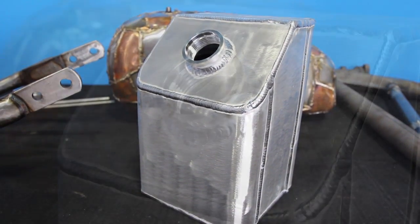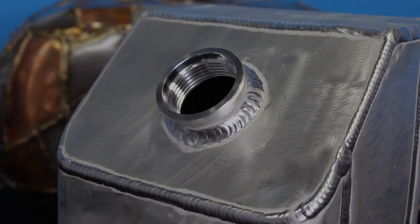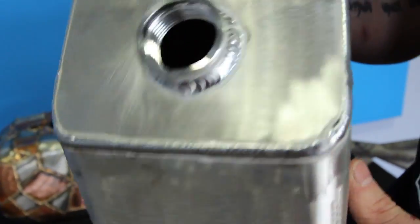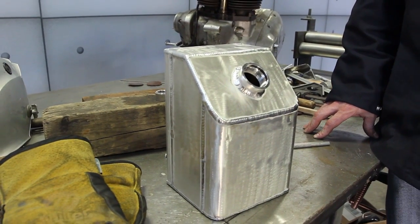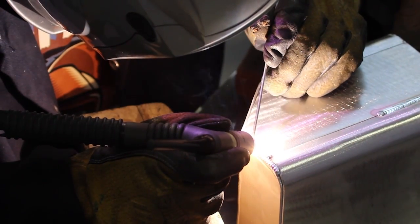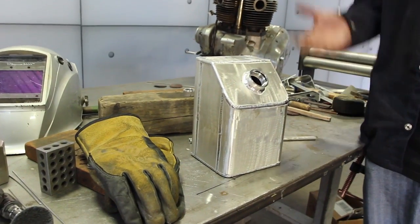Here's the oil tank as far as I've gotten it today. There's a few things left to do — I've got to do some tubing and a bottom bung — but other than that I'm pretty happy with how it's coming out. I got the overall shape I wanted. Basically just started off with some 5052 sheet metal, laid it out how I wanted it, tacked it up, cut it, squared it up, cut it apart, and cleaned everything. With aluminum, cleanliness is godliness — you have to have it clean or it's just not going to weld nice. Put it back together, squared everything up, and put the filler neck in there. I used the Dynasty 200 on this — it's nice because you've got a small package so it's portable, you can take it anywhere, and the fact that it can weld aluminum like this is just a bonus. There's so much adjustability with the frequency and the balance. That's all I use for welding aluminum — that's all I use for welding.